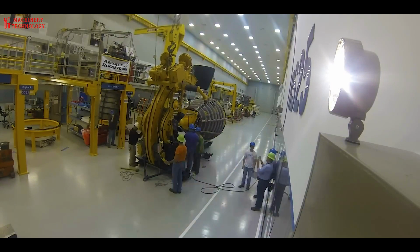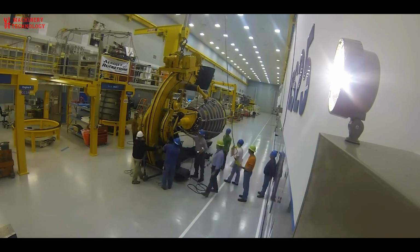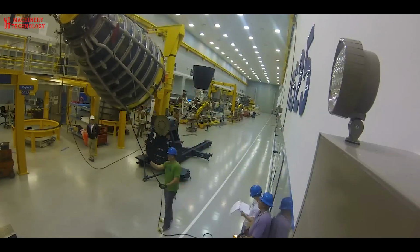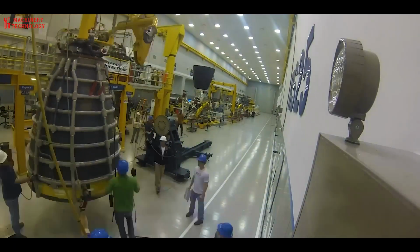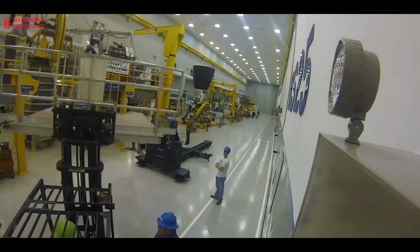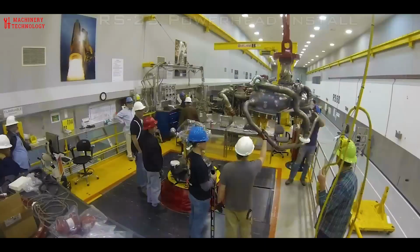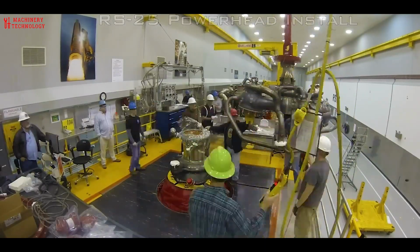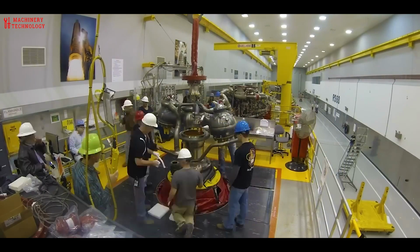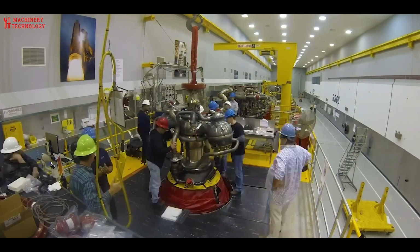Extremely high temperatures created in the chamber during combustion require the wall to be cooled to prevent it from burning. To achieve this, the liquid fuel is fed through cooling ducts in the combustion chamber wall before entering through the injection head. There the fuel mixes with oxygen and is lit by a spark plug. In conventional construction, the cooling ducts are constructed in a blank and subsequently sealed through multiple working steps.